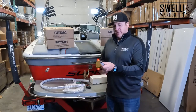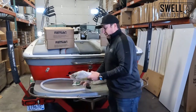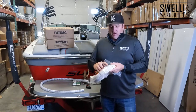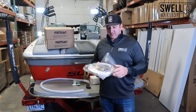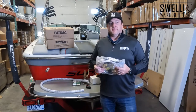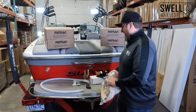These pumps have Deutsch connector quick connects, so if you pick up the fat sack wire harness it's going to click right in. It comes with a two-position fill and empty switch for the reversible pumps, and connections run right to a battery. This is a super easy way to do it — all quick connects, you don't even have to cut or strip wire whatsoever.